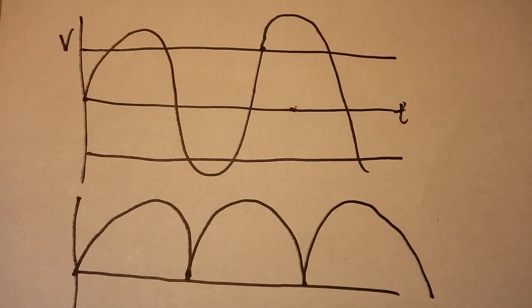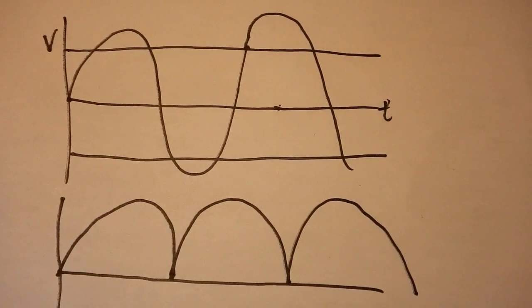In order to go from that rectified wave to ideal DC current, you need a couple of additional pieces: you need a choke coil, which is effectively an inductor, and you need a capacitor. I'll show you what this circuit should look like when the whole thing is finished.